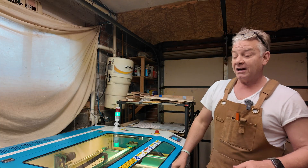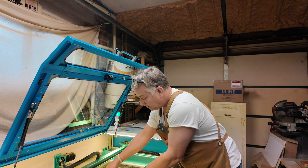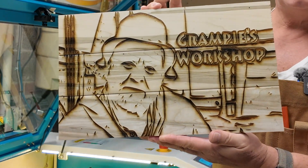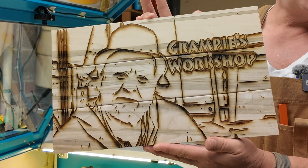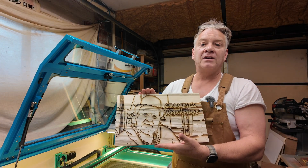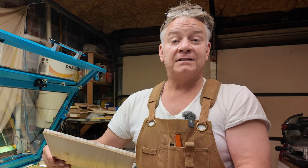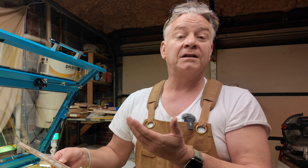We're 57 minutes on that engrave — that was a 15 by 9. Let's take a look out of the laser. You'll see I've got quite a bit of residue on there, laser dust or debris, and from the shine I've also kind of liquefied a bit of resin. But that's par for the course with some of these natural woods, especially when you're using a more powerful or aggressive setting. Some folks prefer to use a less aggressive power and speed setting and do two or three passes instead of doing it all in one. But at the end of the day I've got to sand it anyway, and I want to get that chocolate brown. The deeper or darker the engrave, the more residue is going to come out of the wood.